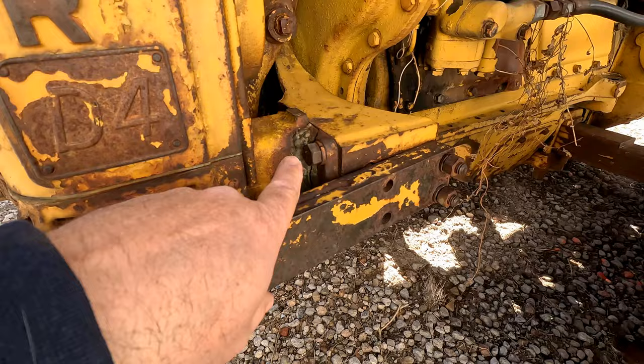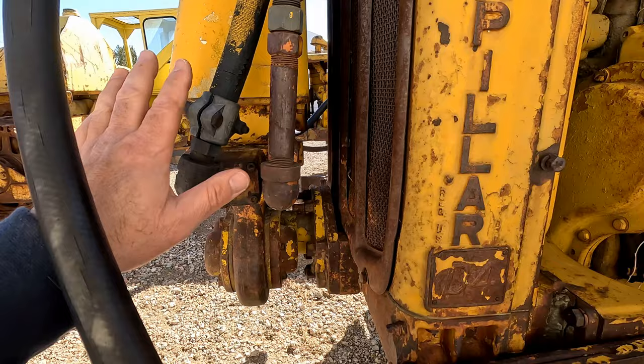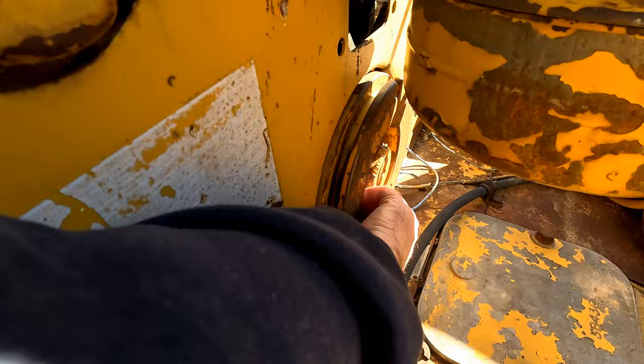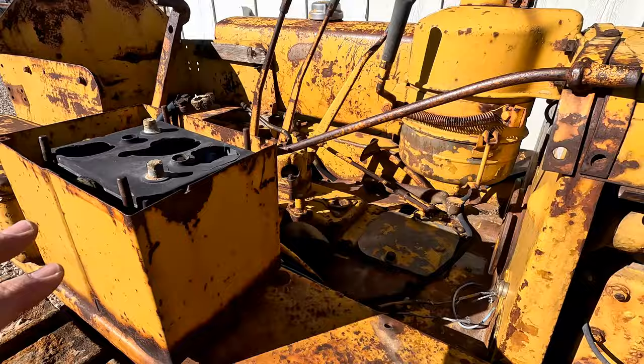Lower radiator tank has been brazed, welded, cracked, and repaired on this machine, and that's not entirely uncommon. There's a lot of stuff hanging on here, this pump hanging up here, and that is why the dozer designs of this area all came off the track frames. This one has no oil, appears no water. The pony motor has excessive amounts of play, but it is free, so that is always a good sign, and always a possibility of being rebuilt.